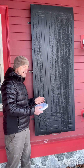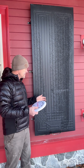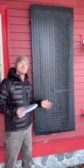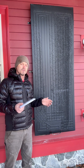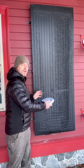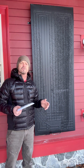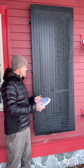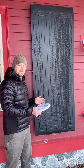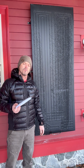Smart Solar tanks are very large — inside is 80 gallons but we go up to 120 gallons. In the summer this system is going to work a lot better. Instead of 900 watts it might be 2700 watts, and the coefficient of performance will go from about 2 — which is what we have right now — up to 4, maybe 4.5 or even 5 if conditions are perfect. This thing wants humidity, it wants sunlight, and it wants moving air. We don't really have much of any of those today, but nonetheless it's working.